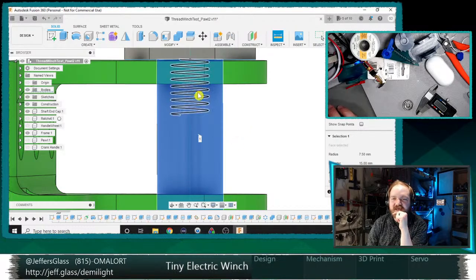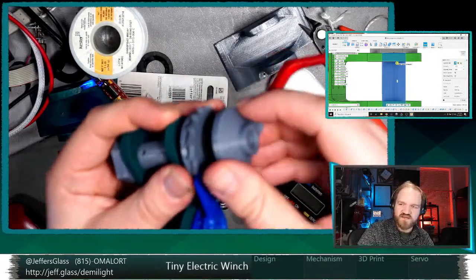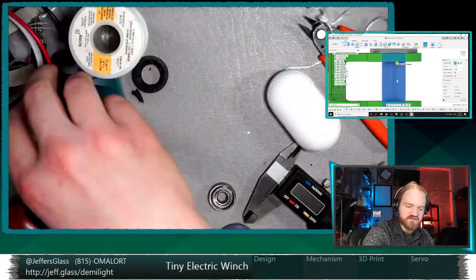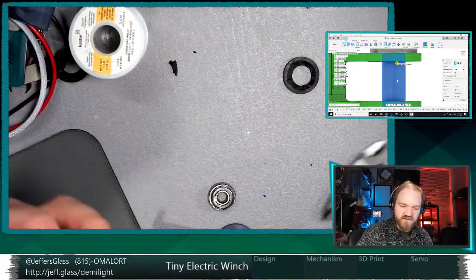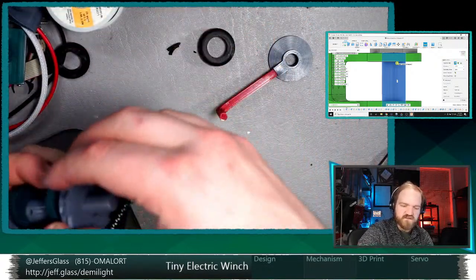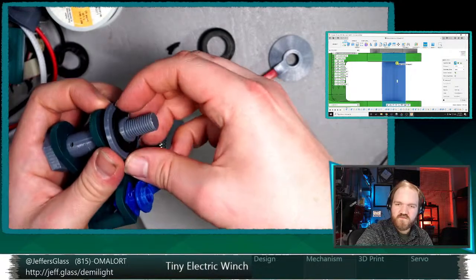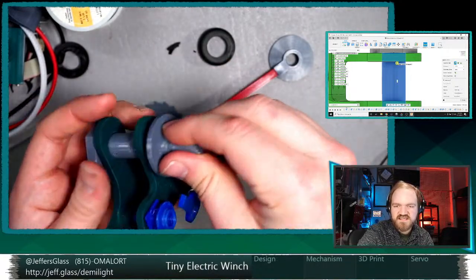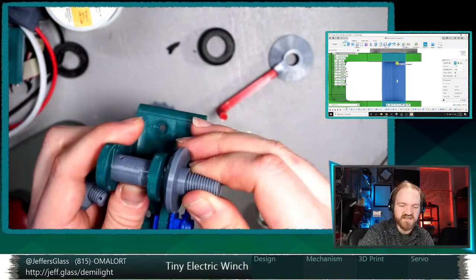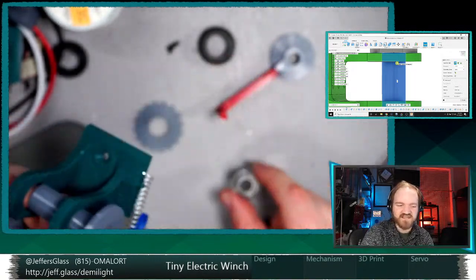Now, we could have a thing that steps down, right? We could have a shaft that, from here. Let's take this apart so we can look at the physical parts as we think about them. Get a little of this other detritus out of the way. So we've got an old friction washer. We don't need that. So we've got our wheel, our washer, our ratchet. Take the pawl off. We've got our other washer. Thomas says ZZ refers to the metal shielding covering the internal ball bearings. The other type is RS, which is a rubber seal, which can be easily removed. I see. So because I've got this metal washer gasket cap thing there, that's because it's a ZZ model.